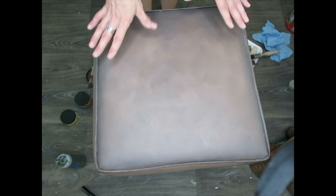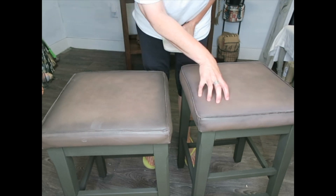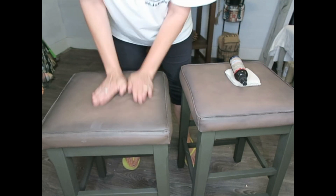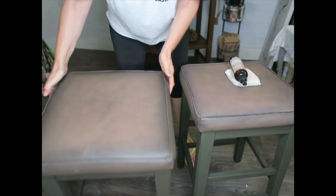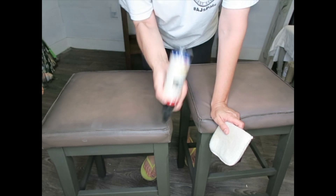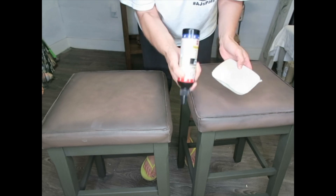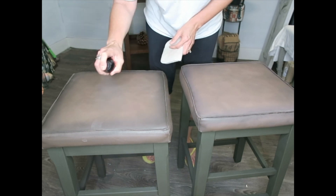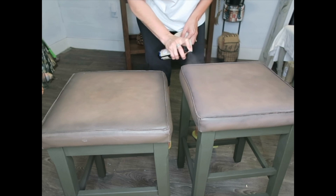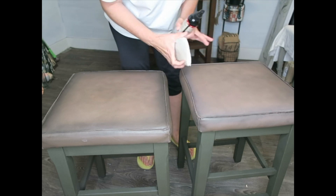I'm going to let this sit overnight and then show you how to seal it with the Easy Peasy Spray Wax. My paint has dried and I have both stools done. I'll demonstrate that the paint does not crack — I can pounce on it, push all the air out, and it's not going to crack. To seal it, I'm using Easy Peasy Spray Wax, which is a water-based wax in a spray form. Shake it up really well, use a cloth — I like Dixie Belle applicator pads, which are like a terry cloth pad. Spray it all over your surface. I recommend doing a sealer 24 hours or more after you've painted — you want that paint to completely settle on your piece of furniture.